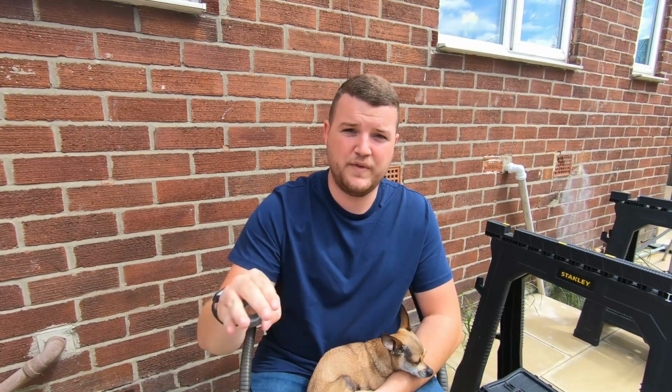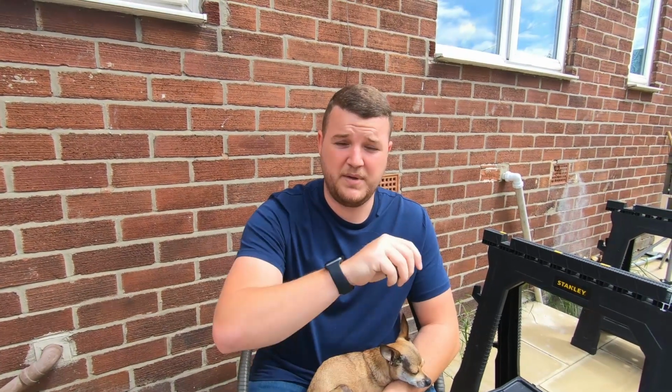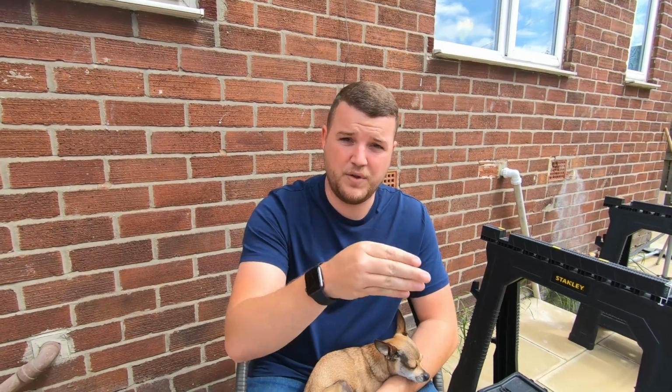So we need to put two recesses in, much bigger, so I'll be needing to cut out the insulation and put them further back. And then we did want to keep the ceiling because we liked it, and obviously we'd painted it, done the spotlights, fan cutouts, everything was done. We wanted to keep it, but when I came to testing the LEDs, we realised that they don't work, so we've had to take the ceiling off. So now we've taken a few steps back, we're going to do everything properly because I'm glad we've realised now rather than in the future.